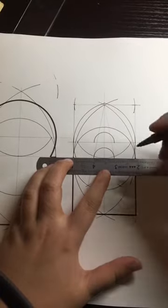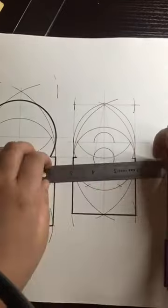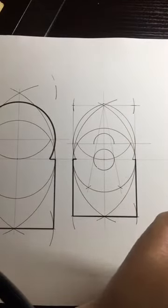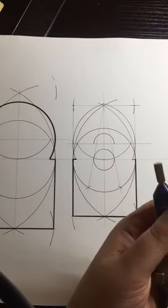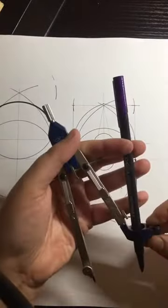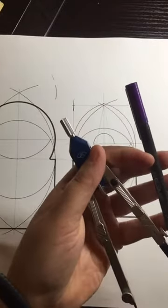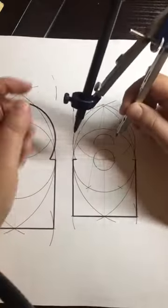Now you can imagine, there are so many examples of two-centered arches. I've broken that line into three. I could break it into four, five, six, even eight. And if I break it into eight, I could do a 7/8 arch, or I could do a 6/8 arch, or 6/8 would obviously be 3/4. So there's lots of variations that you can actually do.